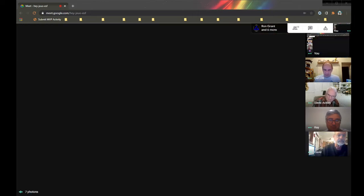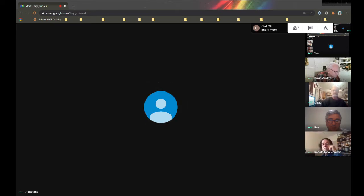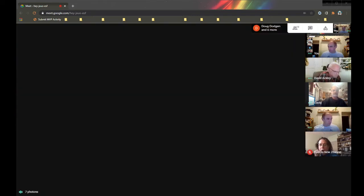Murray, you missed it. The reason they're giving you so much trouble is that the truth is probably sticking anything in there will work. Grab a 1K or something like that. Something that won't pull the power supply down too much while it's running. But you're going to need something bigger than a quarter-watt resistor. You need a path to discharge those. Just make sure the wattage on the resistor can support 12 volts. You're going to need something more than the quarter-watt resistor you probably have lying around the house, I would suggest.